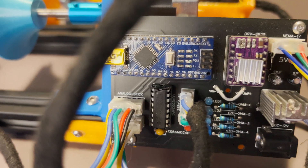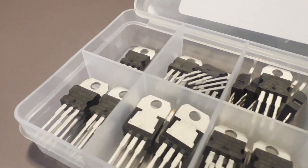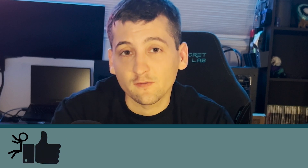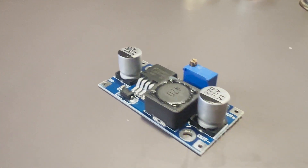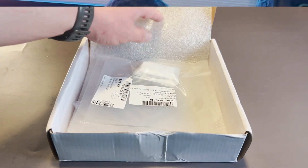It took about a minute to get a coil out, and it also gave me an opportunity to rework the PCB, as some things on the old PCB got a little hot — mainly the voltage converters. They got a little toasty if you ran it too long. So with this model I got away from using those voltage dissipators and went to a true buck converter. My electronics knowledge isn't quite there, so I just used a bought buck converter and set the PCB up to accept one. The PCB was provided to me by PCBWay — more on them later.